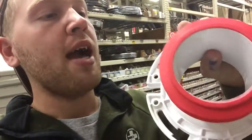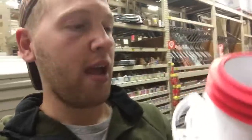It's a little tricky because it's going to go on a three-inch pipe, not the four-inch — but this is the one you're looking for. I ended up taking this off and gluing it to the top of the three-inch PVC pipe right here. You're going to want to make sure that you lubricate it with petroleum jelly or something like that, because you're not going to be able to move it if you don't.